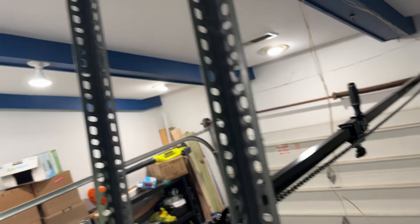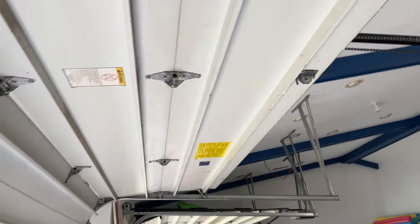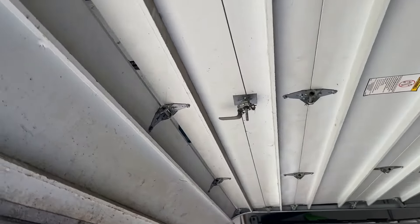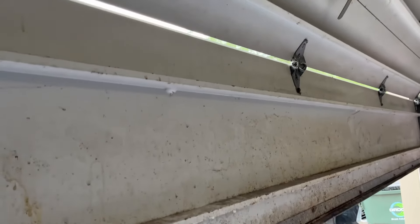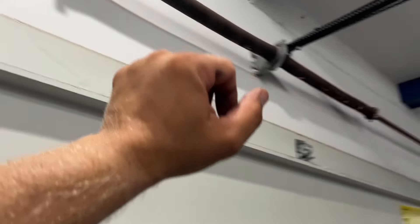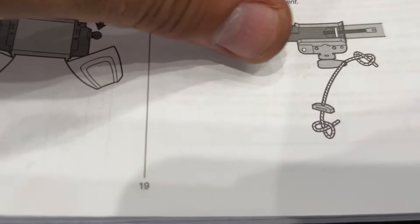I disconnected the old wires and will put everything new. One important thing: make sure when the garage opens it's not hitting the motor — this one is perfectly positioned. Also, see how this door lifts easily — it's not just falling straight down. The tension on the spring is good, the garage opens up smoothly. Make sure your spring tension is good. Now we install the pin into the bracket to pull the garage door — align everything.